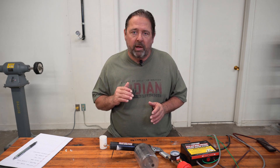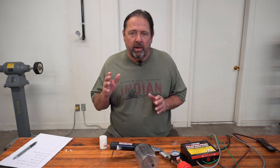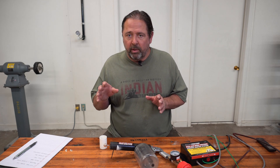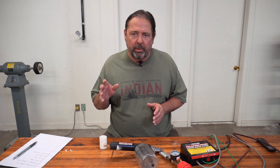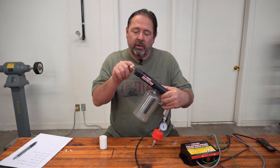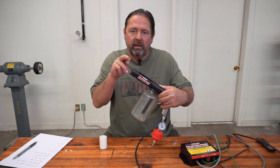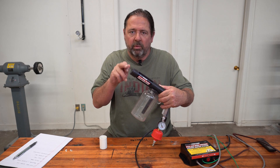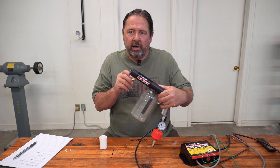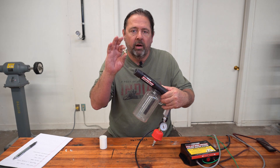Knocking the pressure back down actually works better in this gun. If you're running around 8 psi you're probably wasting powder — at least that's what I've noticed. Run the gun after modifications around 6 to 7 psi. That's why I need a better regulator. This electrode right here is what energizes your powder — this is what gives it a positive charge. Increasing the surface area of this electrode with a conductive diffuser helps a lot.